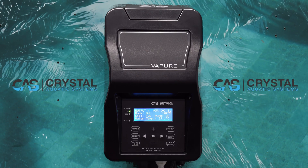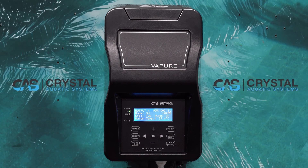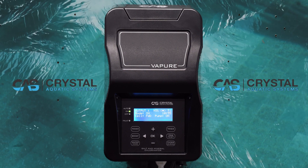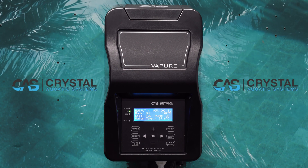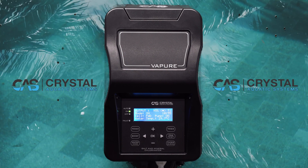Pump setting is a smart feature designed to protect your pump if there is no water flow. This regulates the time the pump is allowed to run after the water sensor on the cell detects there is no flow of water. The pump will be turned off from 3 to 10 minutes after detecting no water flow.